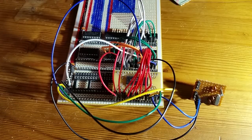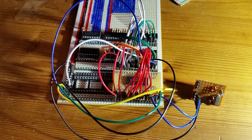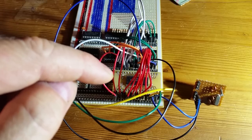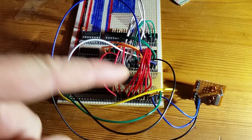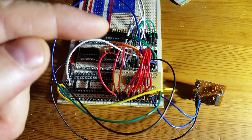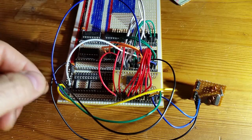There are also some resistors here because these can be configured as input or output — so potentially you could program a chip in here. But as I'm going to be reading, it goes through 1k resistors just in case the Raspberry Pi is set to output and the memory is also outputting at the same time, so they don't pull too much current down the IO lines. I could be reading the program memory from this microcontroller from the car ECU, and luckily the datasheet for this microcontroller has a mode in which you can actually read the data from the program memory. This is a mask version of the microcontroller — there's a one-time programmable and an electronically erasable version — but the mask version is manufactured specifically with a program in it.